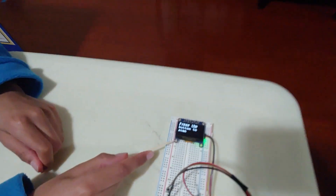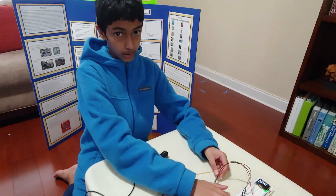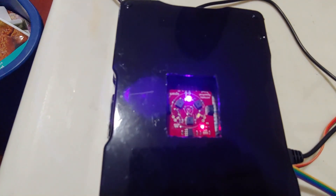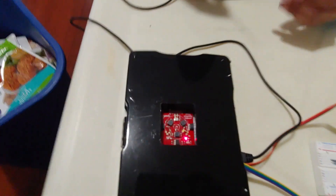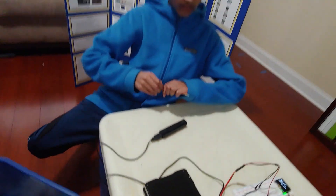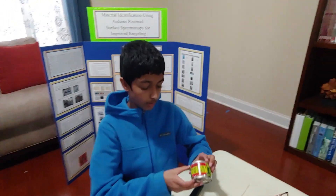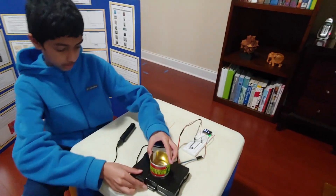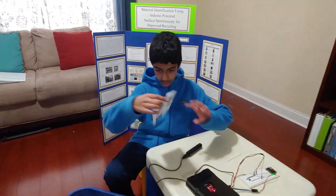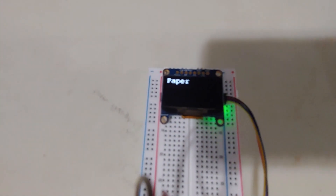I've connected a display to show the results of a scan, and whenever I push this button it runs the scan routine programmed into the Arduino. You can see that each LED illuminates in sequence — first the visible LED, then the IR LED which is not visible to the human eye, and then the UV LED. So now I'm going to scan some of these materials. This is a can of green chilies from Trader Joe's — and you can see it's scanned as metal. Next I'm going to do this paper envelope — and it's scanned as paper.